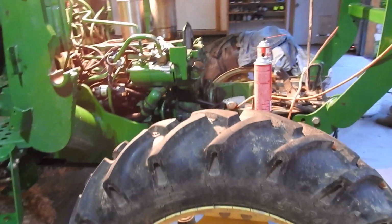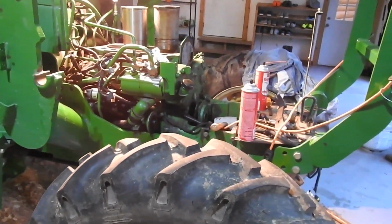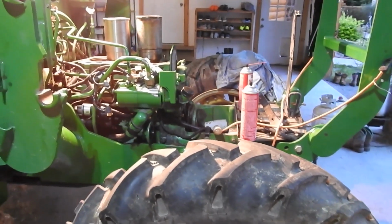The original part number, I think I showed you guys this, is on here. It's R502260, right? And then the kit that I got, that includes the new liner and has a piston in it, is 520768. They checked, it's a 5065E. They confirmed that. I went through and told them my engine. This tractor was built in India, assembled in India, and the motor is a 3029T, and it's PY22. They checked everything and said, yeah, that's the liner for it.